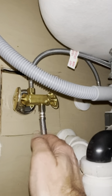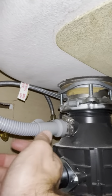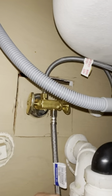So you're potentially going to need a new, different-size stainless steel supply line, and you're going to need a new drain as well. The one supplied with the unit won't fit if it's an older dishwasher — it's actually a different size, thicker and wider — for more water going in and more stuff going out.